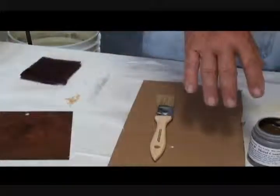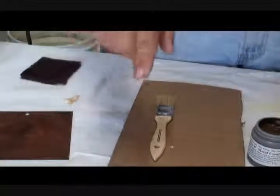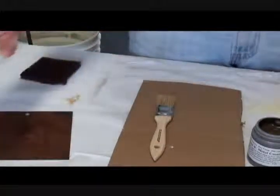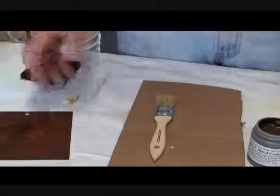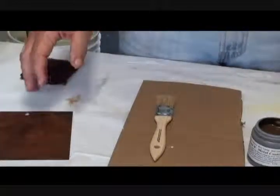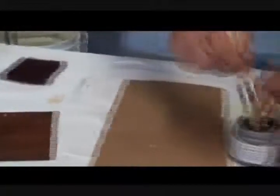Because with the metal coating, when you put a real patina on it, being an acid, that acid migrates through the coating, through the metal, and starts attacking what's underneath. If you don't have a good primer, it's going to attack your metal, and you're going to get rust. And some people like that. I have friends of mine that'll take, let's say, bronze, take a piece of steel, go like that, and then shoot it with patina, and you'll have some bronze showing with rust showing in other areas. Very pretty.